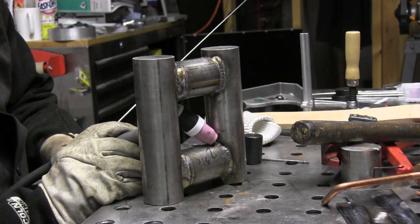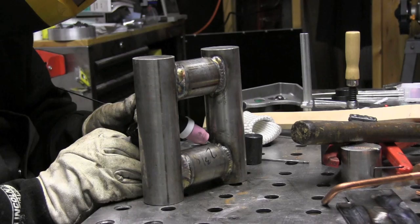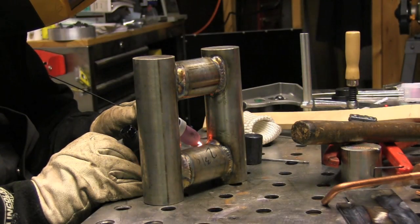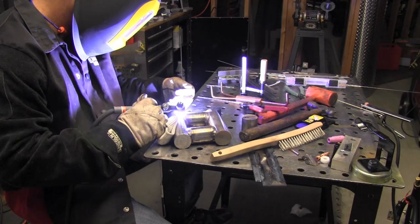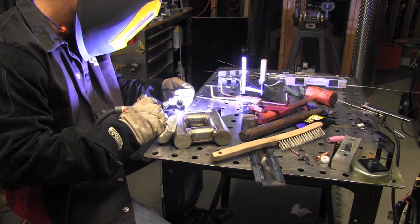Another reason for the stubby gas lens with the short button cap is getting into situations like this — sometimes you need as short a torch as possible, and sometimes you wish you had an even shorter one. There are other torches that will get into tight spots like this, like a number 24 style torch, but a stubby gas lens will let you get into a lot tighter places than you can with what comes with most torches. We'll do a little shot of the cover pass — just pushing in enough rod. I'm using 1/8 inch 309 filler here and pushing a little bit of extra rod in most of the time.